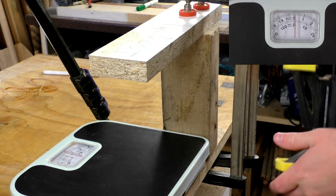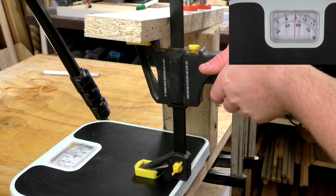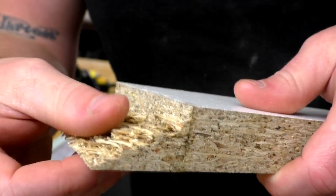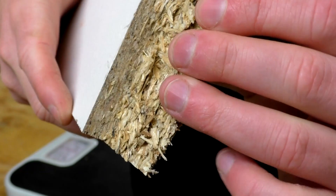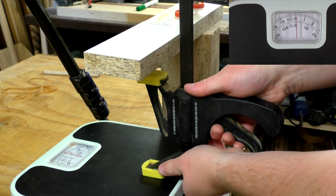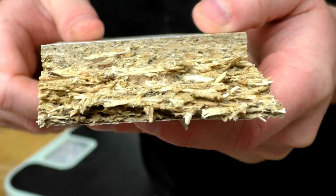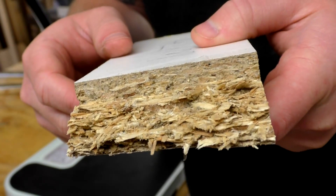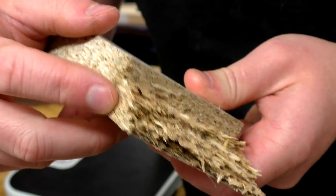The first joint is melamine without a biscuit. That joint failed partly at the glue joint and partly the board itself breaking — about 30% glue joint fail and 70% board fail. Next is melamine with a biscuit. This one has also failed partly at the glue joint. Breaking it open, you can just about see the tip of the biscuit, but it's fully embedded within the rest of the board. This is remarkably similar to the first melamine board — failure is probably about 30% glue joint and 70% board.